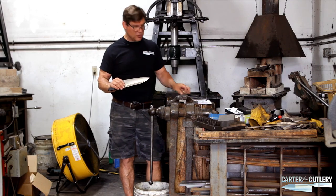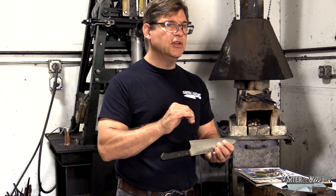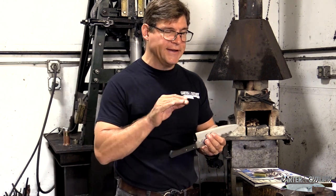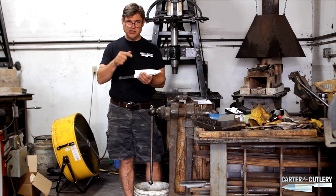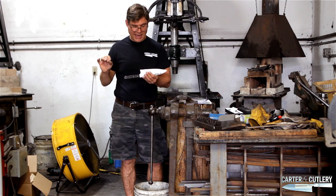The last thing I can do is normally go out into the sunshine and look straight down into one of those chipped portions — using a magnifying glass if I need to. I'm going to see: do I just see a dull, matte gray surface? Or do I see something that's really beady and granular? Without comparing large-grain fractured surface with really refined-grain fractured surface, it's hard to tell as a beginner. But if you saw enough pieces of chipped or fractured steel, you would know — sometimes it has a really fine, dull, gray matte color versus very granular, almost like grains of sand.